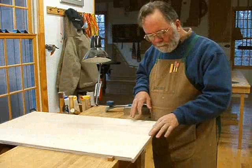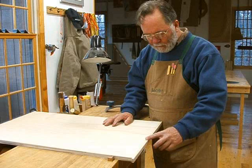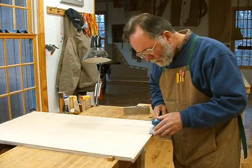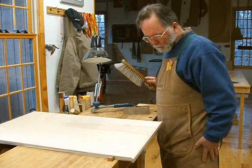The front maple edge banding is now connected to the dust dividers that go between the drawers. As I said, I cut them a little bit proud, so now I have to take off just a little bit to make the surface nice and flush. First thing I'll do is use my carbide scraper to get rid of any glue bumps. You've got to be very careful that you're not cutting into the plywood because the veneer on this maple veneer plywood is very thin. I'm just trying to get the big glue bumps off so that I'm not planing them off with the planer blade.